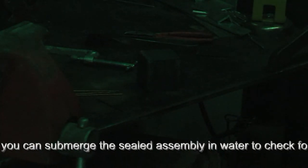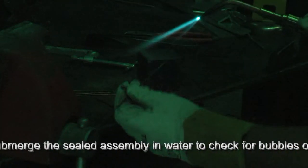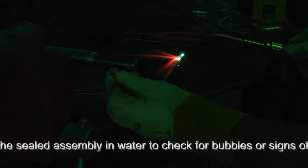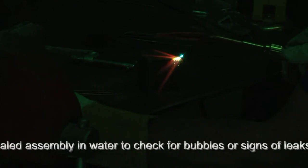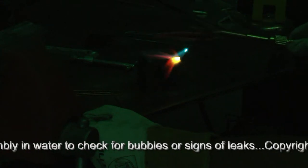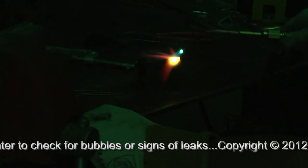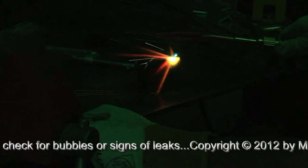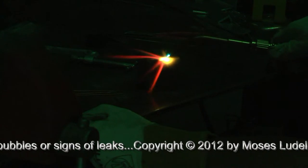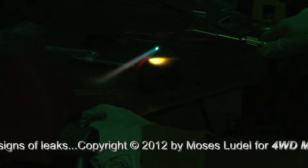With this amount of heat, I'm going to step up to a 3/32" filler rod and we'll see what the difference is. In this case I've got a slight overlap so I'm not going to use any filler at all. I'm just going to create a puddle, fuse the metal, and without the introduction of filler — favoring the high side so I don't get an overlap or a rundown on the low side piece — I'm just going to move this heat along and create a bead formation to my satisfaction.